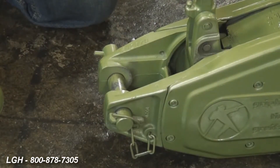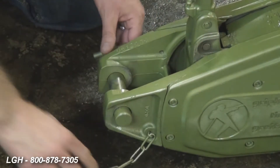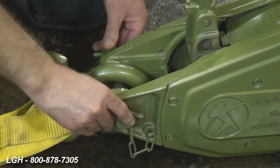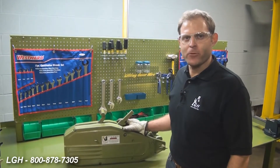Pertaining to the anchoring point of this hoist, it's located near the rear. Simply remove the cotter pin, slide the pin out a little bit, re-engage it, and re-secure the cotter pin. I want to take a few moments to highlight some nice features regarding the grip hoist machine itself.